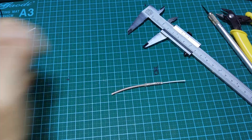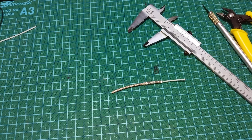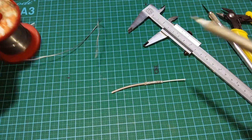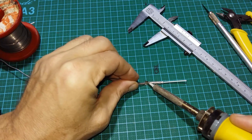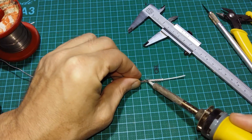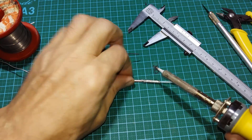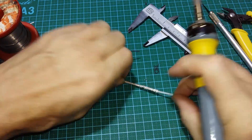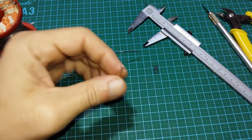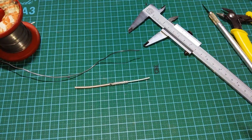To finish this part, make a little bit of solder. I will use another soldering iron which is preheated to 300 degrees Celsius, and just make a blob of solder so that it does not move. Now, this is one part. Let me solder the first dipole antenna.